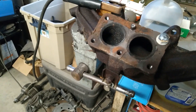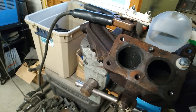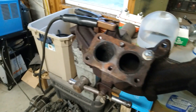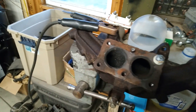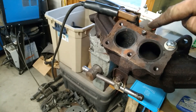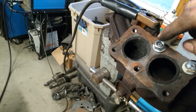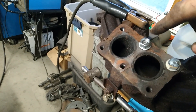If you screw that up, then you've got to oversize the hole, then get thread inserts — helicoil. But if you do have some stud sticking out, what you can do is get a nut that's a little bit bigger than the bolt you're trying to remove. Take your angle grinder or file and clean up all the rusted metal to get down to solid metal. Clean the top off the stud that's sticking out, put a washer on there, then put your oversized nut on and you've got a little dent right in the middle. Starting in the middle to make sure you get a good burn in on that stud, just start welding — start there in the middle, get it nicely burnt in and then just come around and do a little circle.